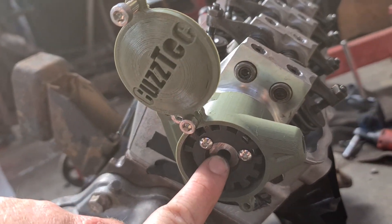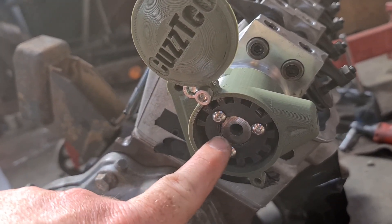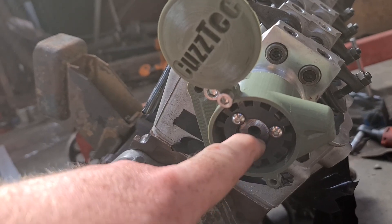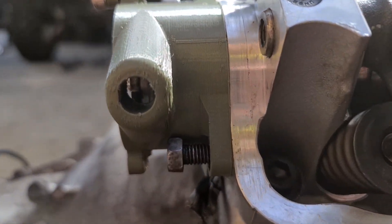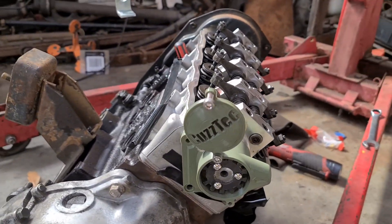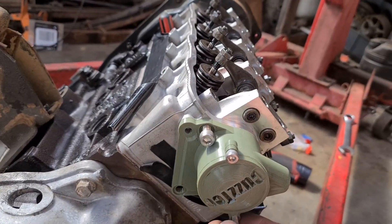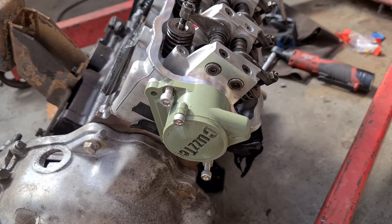You can see I had to cut the end of the cam off just a little bit - it just made all the clearance easier. The next trigger wheel I'll make will just be solid rather than have that indent in it - it doesn't need it. If you've cut about 15mm off the end of the cam, you just measure it off the trigger wheel. The trigger wheel's going to allow for a gasket in there to bring that back another about a mil, which should sit about dead centre. The housing screws on - that's pretty cool.